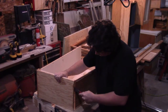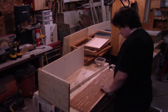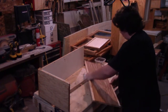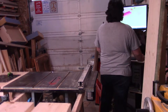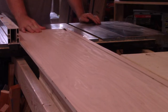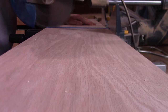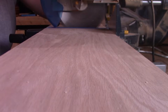My original thought was to salvage as much material as I could, so I brought as many of the old cabinets as I could to disassemble for reuse. I wasn't able to get as much out of them as I would have liked, but I was able to get some usable material out of them still. With everything torn down and moved out of the way, I pulled up the SketchUp model on my shop computer to reference my cut list and started breaking down sheets of plywood to rough width at the table saw.